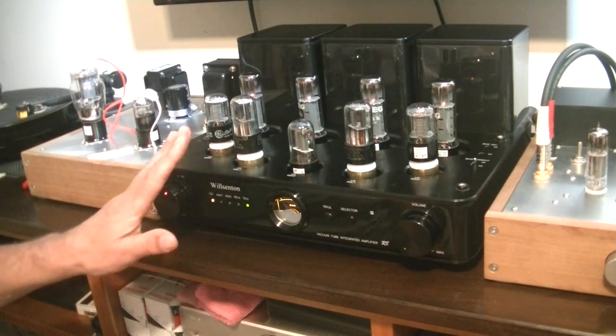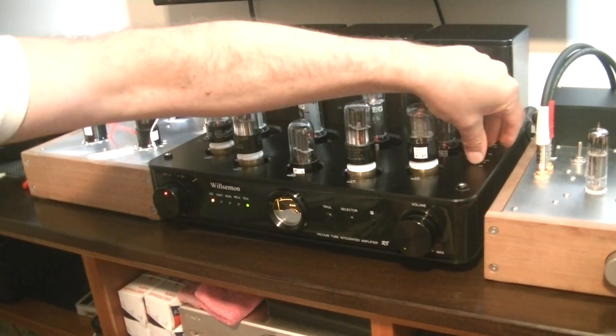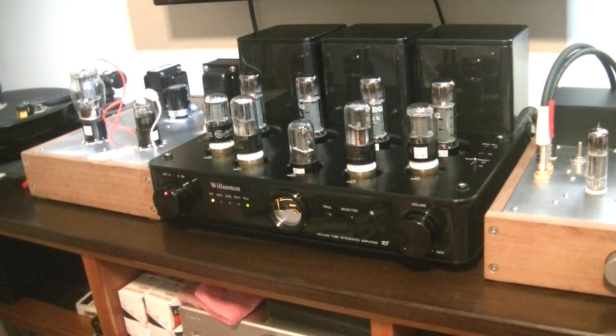Let's take a look at V3 and V4 — they were set earlier before the shoot and they're perfect. When you're first putting a new set of power tubes into an amp, keep an eye on them. Don't walk away. If they get into trouble — making a lot of noise or red plating — shut the amp off right away and figure out what's wrong before you destroy something. Red plating can not only destroy the power tube but can start burning out components in the amp.